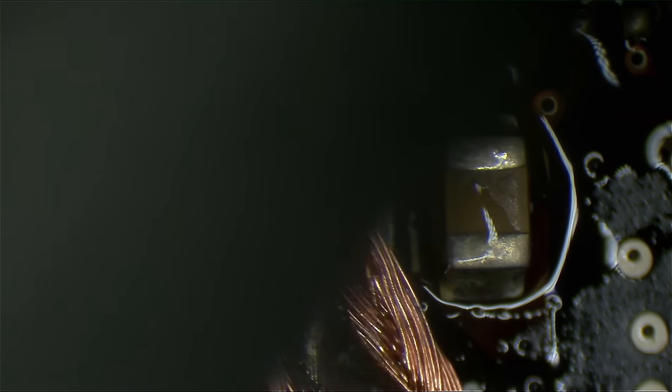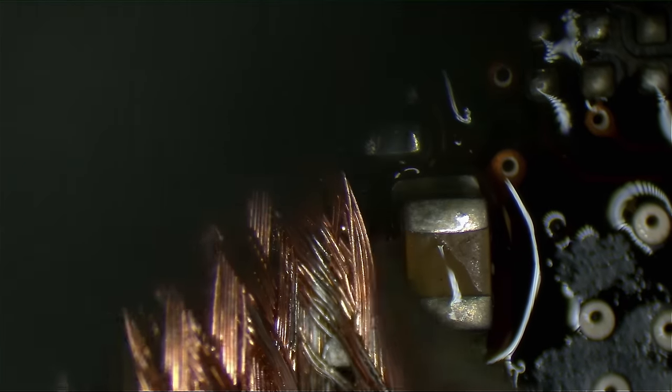But let's just start from scratch here. We're just going to wick away that old solder. We're going to add our own solder in there and solder in a nice new chip. Put a nice happy new chip and a happy new PP1V5 S0 circuit for a happy board.